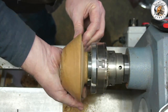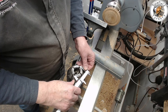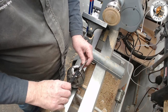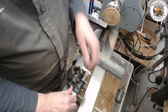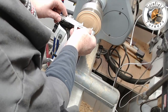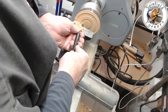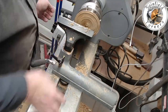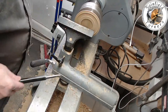I now need to finish the rest of the shaping of the inside of the lid. My intention is to create a mortise on the inside which I can use with the O'Donnell jaws to grip it in expansion mode, just to finish off the knob at the top. I need to get the size right so I don't leave any dents from the dovetail on the jaws. The mortise is only about a millimeter deep with a nice little undercut from the small skew chisel, which is good enough for the O'Donnell jaws to grip quite safely.